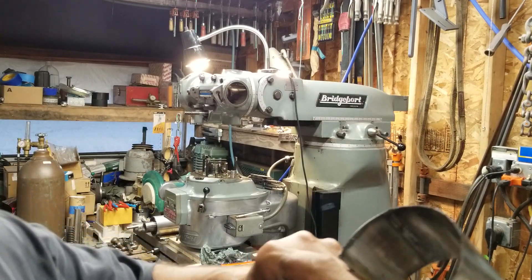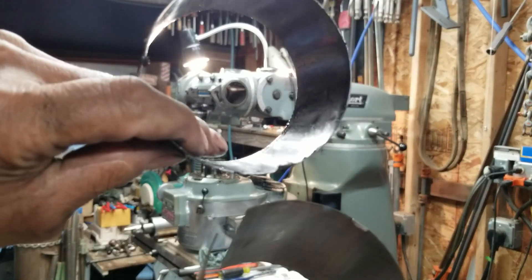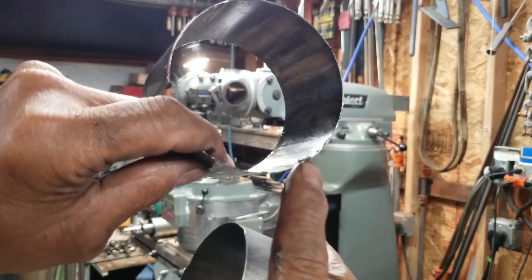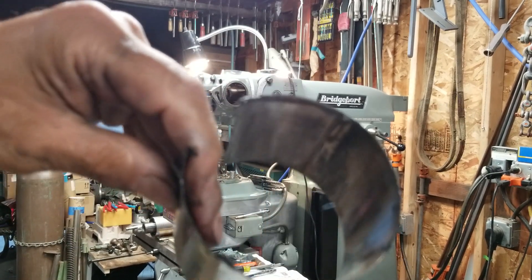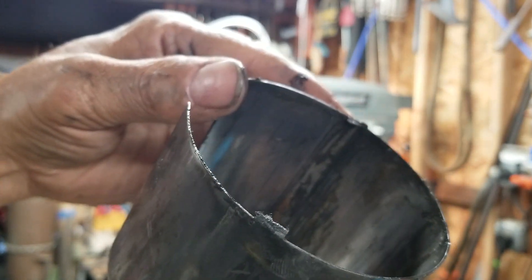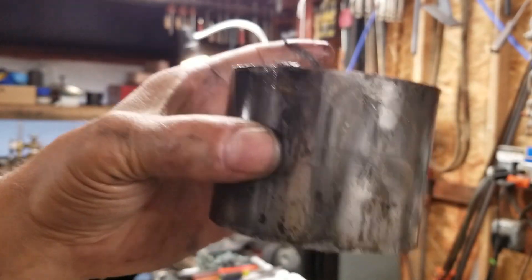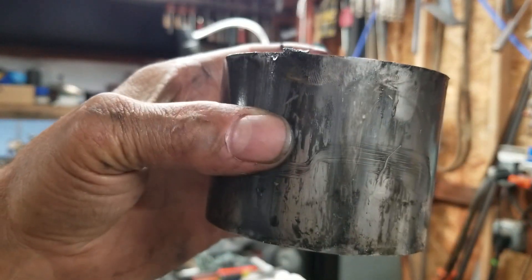Now that I have this out here, let me show you guys. Gotta put on my damn spectacles so I can see. Now, looking at my camera from the back side, you can see these little tabs on the good one here. And this one's all messed up — that tab is practically missing. It looks like it's bent over. I don't know how in the hell that happened, but this is the friggin' problem with me putting my quill back up inside the damn housing.